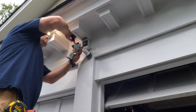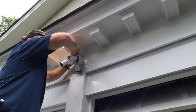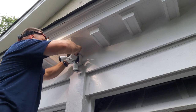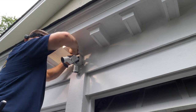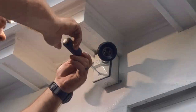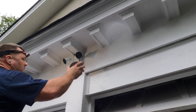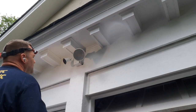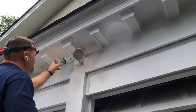On this three-hole cover plate, two holes are occupied by the flood holders, and the middle gets a blank that threads in. Unique to this piece of equipment is a ground screw attached to it — you have to bond that as well. Make sure you use the gasket between the cover plate and the box to keep water out. I'm installing PAR 38 LEDs equivalent to 90-watt halogen — 1,200 lumens at a 3,500 Kelvin temperature rating.